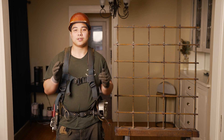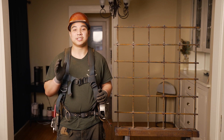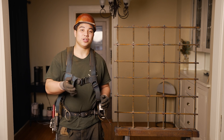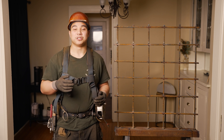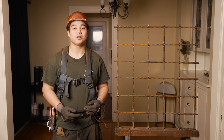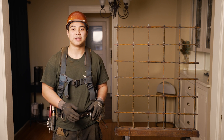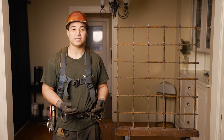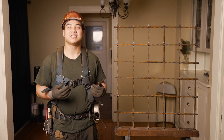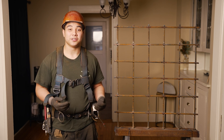Now that we've twisted our tie a second time, no matter what you do with the tails, we're going to go on to our next tie and just continue this process over and over again. In rebar, you'll be doing hundreds to thousands of these ties every day, so get comfortable doing it. Now I'm going to show you guys six consecutive ties with the foremost bar perpendicular to your eyes.